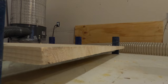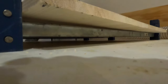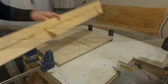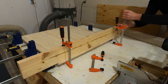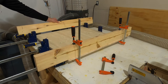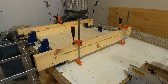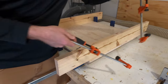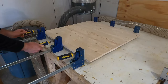The boards lay down pretty flat, but sometimes they'll be a little bowed or the clamp can bow them slightly. If one side is bowed upward, you have a couple of options: push it down and tighten the clamps, or — the way I prefer — clamp another flat board across the two pieces. Because that board is already flat, clamping it on top forces the tabletop boards to lay flat. Then tighten those clamps, tighten the big bar clamps, and let everything dry for about four hours.